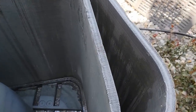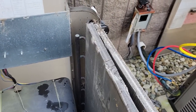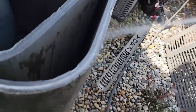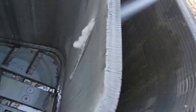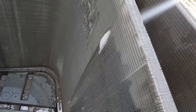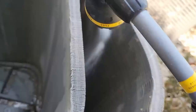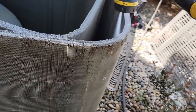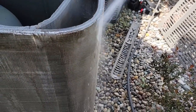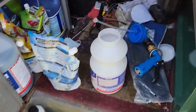We had to snip two wire ties to separate it. This is what they mean by splitting the coil - comes over to here and attaches at the back, so now you can wash right through it. You have to do one at a time. See how much is coming through now - that's just crazy. And then this one here isn't going to be too bad because it's never gotten through the first one. We'll probably go ahead and run some cleaner on it - just helps speed this up a little bit.